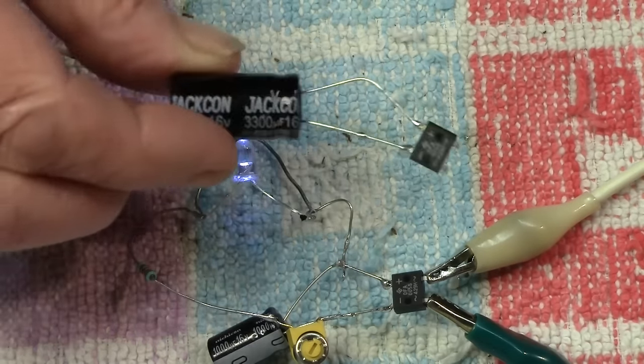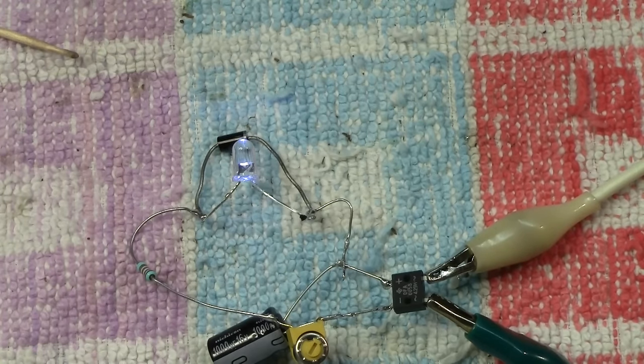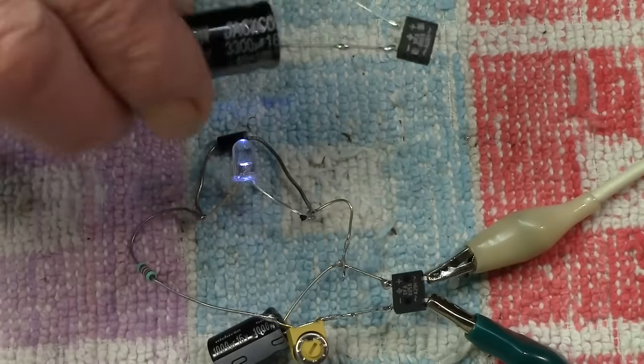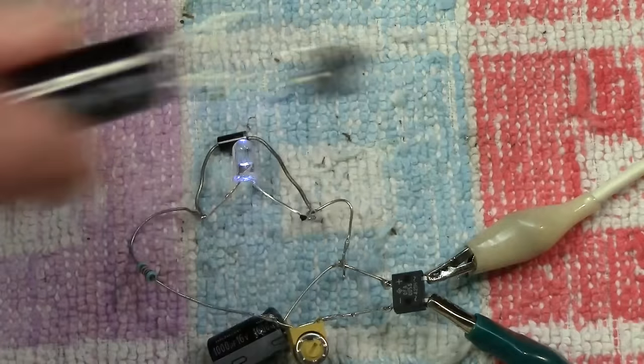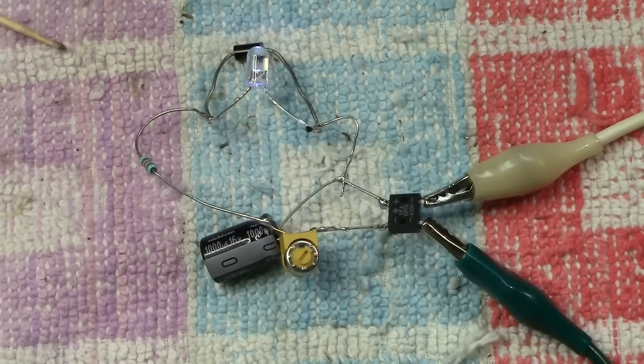What would it be like with 3300? Well, I can tell you what it would be like. You'd be able to stop at a station for a while, at least a good few minutes. It's starting to fade a bit now, but you'd be able to stop at a station for quite a while with the higher capacitance of 3300, and it would stay lit until you're ready to move the train on. So look, that's it. That's how it works. It's all down to you now to put it all into practice.